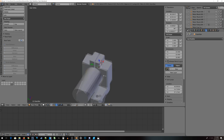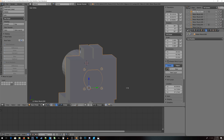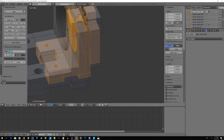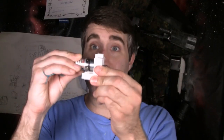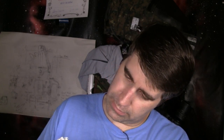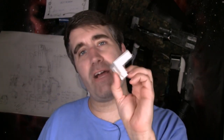Here's how we're going to fix that. I'm going to make the hole where the motor sits just a little bit larger, as well as the opening, and I'm also going to increase the size of the screw holes. Motor mount revision 2 — let's see how it fits this time. Much better indeed. It fits both ways, and I can rotate it to the correct facing. I just need to clear out a little bit of support material, then get this guy in the robot and see how well that fits.